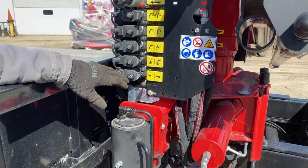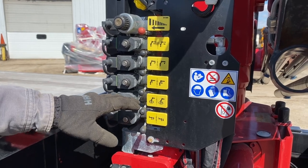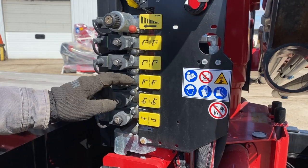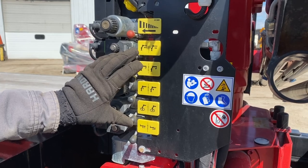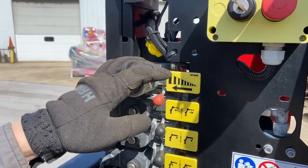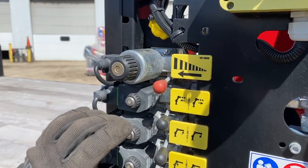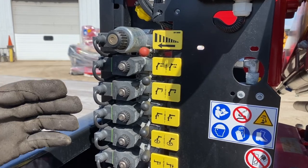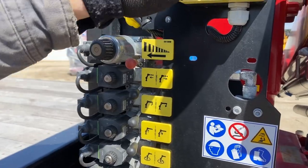Controls for the different functions of the crane are all listed here. Typically, they're based on where rotation is, stabilizers, usually one side of it, and then main lift, secondary lift, and extensions. It's pretty consistent across all cranes all over the world. On a remote control crane with this Bosch valve, you've got an extra function here, which actually controls the oil flow. To operate anything on the mechanical controls on this particular crane, you operate the function, and you control the oil with a second operation. You need two hands. Two levers have to operate before anything will move when you're in manual controls.